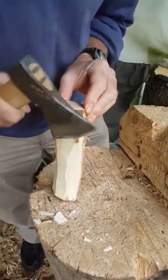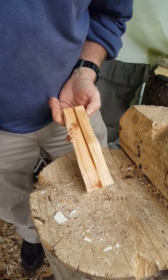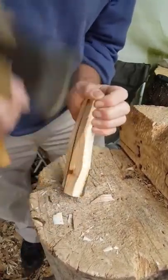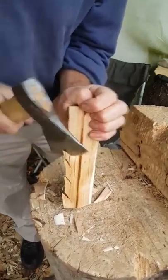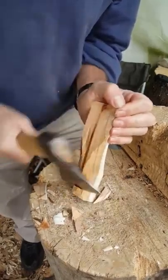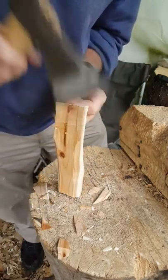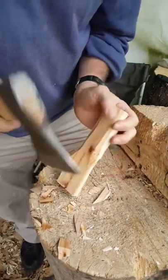If you're a beginner, don't mark that near the end. I want to make sure it disappears as I carve. What I did before is clear a lot of each corner going back down — this is on the back of the handle — and then that middle bit becomes quite straightforward and you're not having to fight a great width of wood. This piece still has to disappear from here eventually, so I'll clear all that. This is the back of the bowl.